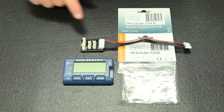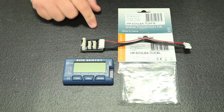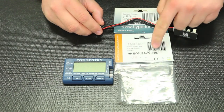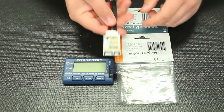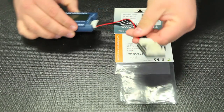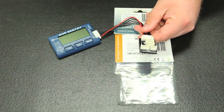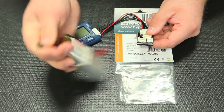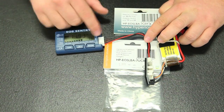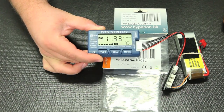We've had a few questions asked about how to make the Sentry pack checker work for Flight Power batteries or even Align-style batteries. We came up with a simple solution here at PowerRC Hobbies. We found that if you take a 720i series wire harness for the balancers as well as a 720 series Hyperion balance board, you can get the proper breakout pins for Flight Power batteries. All you do is plug it in just like a LiPo connector, and here you'll have your regular 2-cell to 7-cell max for the Flight Power batteries. Here with a 2 to 3 cell Thunder Power battery, we just plug that in right there, and as you can see we have our data shown — just the same as if we were plugging directly into the unit. Just a cool little tip. Both of these are included with the combo, so you'll be able to make it real easy on yourself and order one combo and have everything you need.